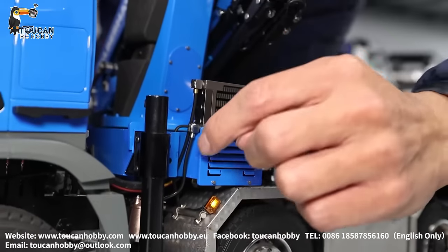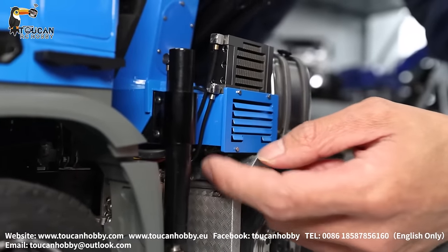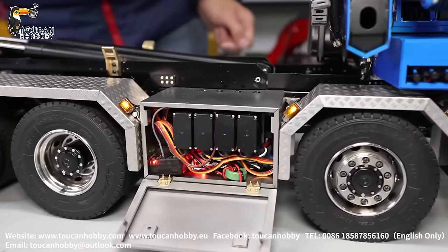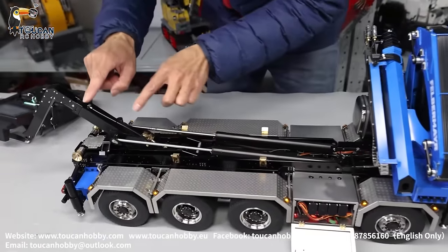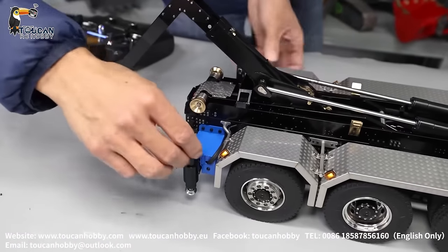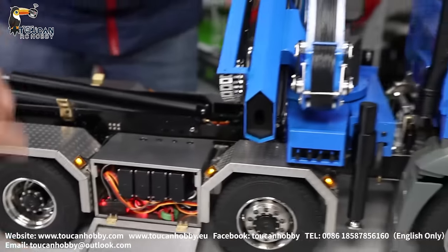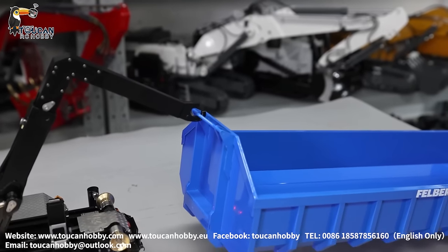Under the cooler, at the chassis of the crane, inside here, is the pump, a small pump with a brushless motor. Now let's turn around and see the right side; this steel box opens. That's a 4-channel valve controlling the damper: 1 channel for up, 1 channel for sliding, 1 channel for the arms reaching out, and 1 channel for the legs reaching down. The 4-channel valve is here, and also the first receiver. Another receiver is inside the cabin. So 2 receivers are controlling.